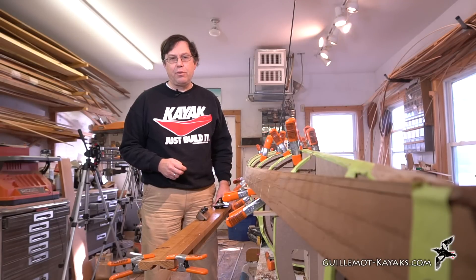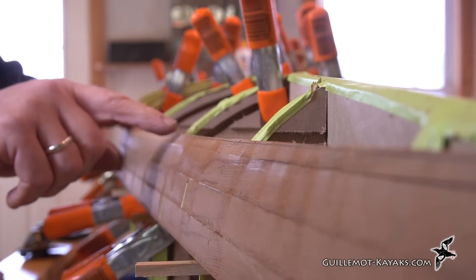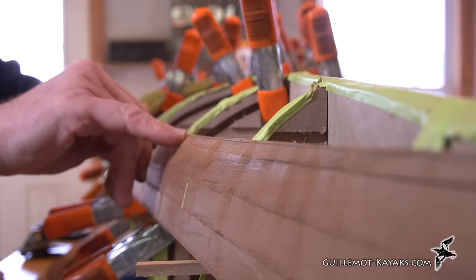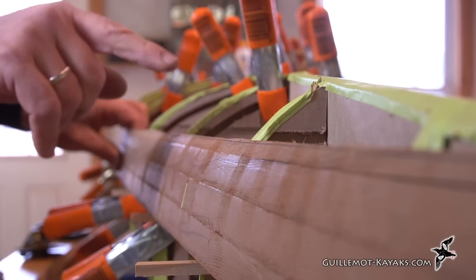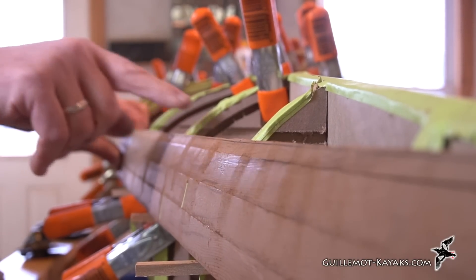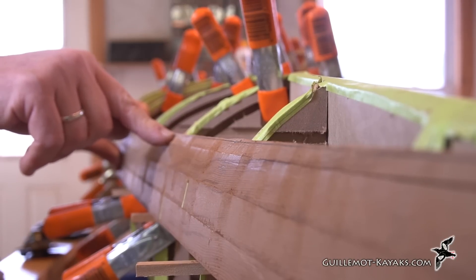I hope you enjoy this, and if you have any questions, post them in the comments. Yesterday we cut this waterline with a saw, and today we want to get it straight and level. We were using this pencil line here as our guide. Do not get focused on that pencil line — what we're trying to do now is get this edge straight. The pencil line is no longer gospel; that was a guide for our sawing.